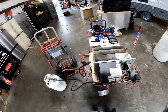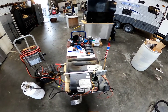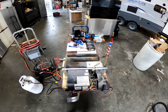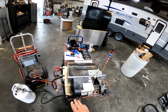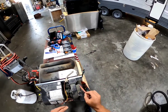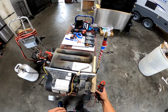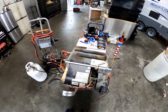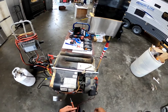Good morning guys, welcome back. Today, since we had a furnace pulled, this furnace is not operational right now. It will come on, it will tick, it will not ignite — you're not getting any flame, you're not getting any heat from this furnace. So I figured why not go over furnaces, because I really wanted to have one pulled so I could show you where wires are going to help answer questions. This is a Suburban SF-25, so this applies to Suburbans. Atwoods work real similar, but when we get to one of those, we'll point out the differences.